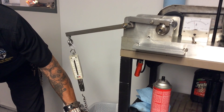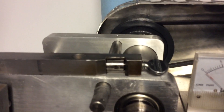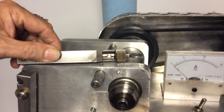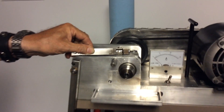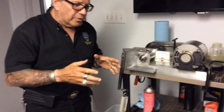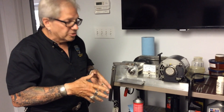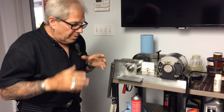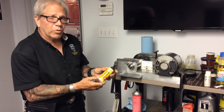And there's 25 pounds. Take a look at the spot — before it was dull, but now it's shiny. It's been lapped, rolled out, and basically resurfaced and re-hardened so that the wear pattern has stopped. Weapon Shield incorporates the advanced boundary film: it recreates that surface and sets up a boundary condition that withstands enormous pressures — that was about 1,800 pounds on that area, which is quite larger than point-to-point. As people want to see where this goes on extreme pressure and anti-wear: G96 is average; Weapon Shield is far above average.